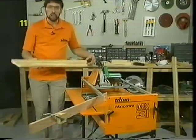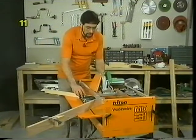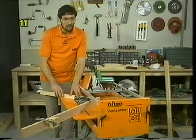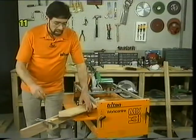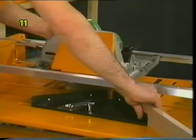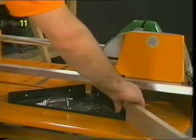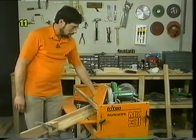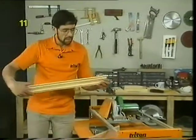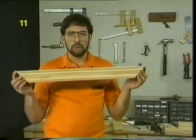Then take all your long pieces and cut the first cut on face A of the protractor. Try to set face A at 45 degrees as close as you can, but it's not essential to be spot on. Having cut face A, you can butt the piece into the stop block and then cut the complementary reverse angle — and every piece cut this way against that stop will be exactly the same length.